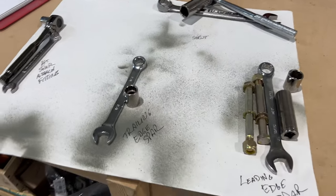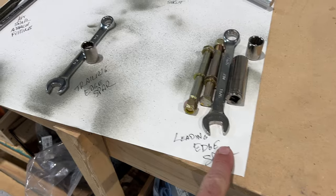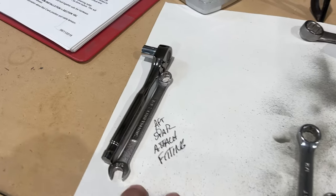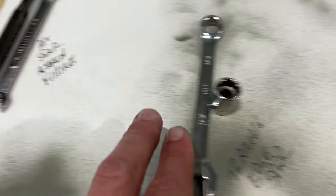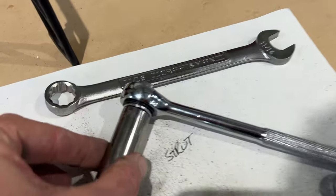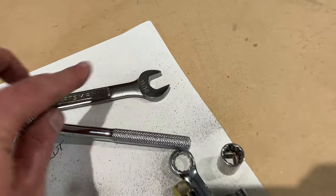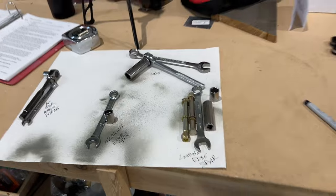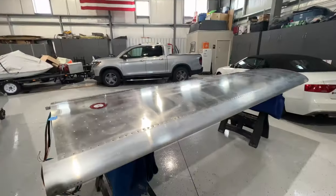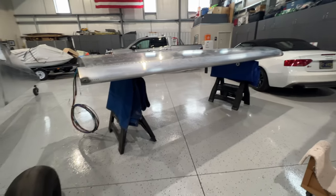Trying to be organized while waiting for helpers to arrive. We've got the leading-edge spar bolts and hardware here, the trailing-edge spar bolts are already in station three, and here's the hardware. The aft spar attach fitting measurements: 3/8, half-inch, 9/16, and the strut is unique — it uses a 5/8-inch bolt with an 11/16 nut. Everything's ready to go. The order of installation is: station three, then the aft spar, then the forward spar, then with someone at the wingtip still holding it, do the wing strut.